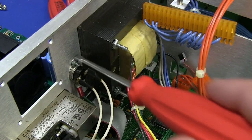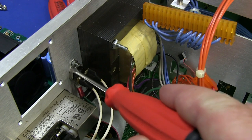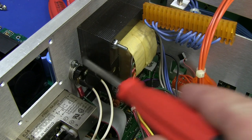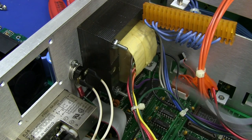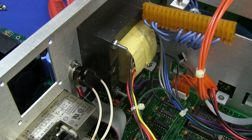Look what we have here — this is interesting. We have a thermal cutout for the transformer, mounted onto the back panel. Since the transformer is directly mounted on there, it's as good as mounting on the transformer directly. So overheating protection for the transformer — very nice. It just switches off the mains input.